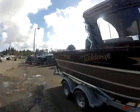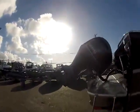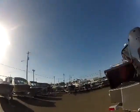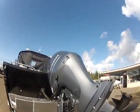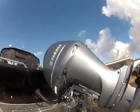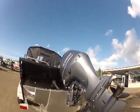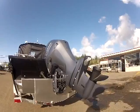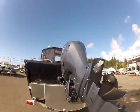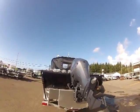We're going to go inside the boat. But before we do, let's talk about this new 200. This has been a proven seller — the Yamaha 200XB inline four-cylinder. It's three pounds lighter than the 150. Acceleration is probably 35% greater out of the hole. It kicks in about 2,200 RPMs, almost like a turbocharger, and that's because of the variable cam shift timing.